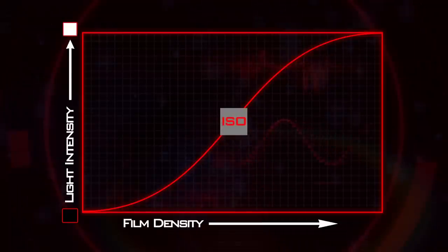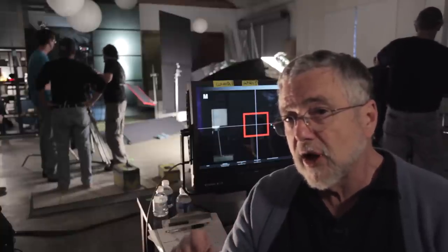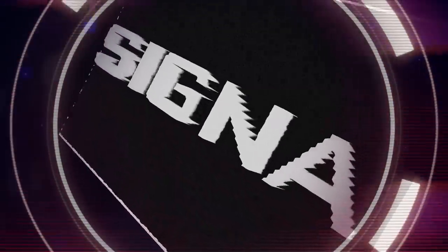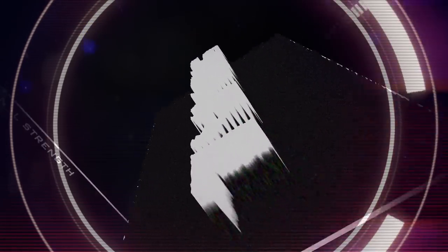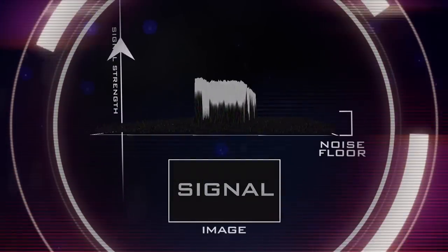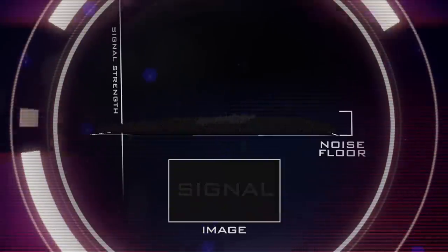Sensitivity in video cameras is much harder to define, and the reason is video cameras have got all sorts of different contrast scales. And so sensitivity in a video camera should be measured in the amount of signal to noise there is in the blacks. And if there's a signal in the blacks, there's actually a signal there, and when that signal gets to be the same level as noise, you generally call that the threshold.